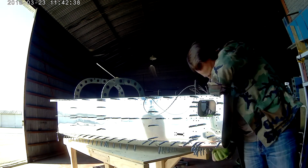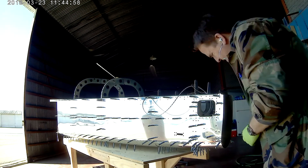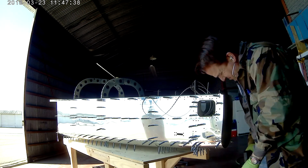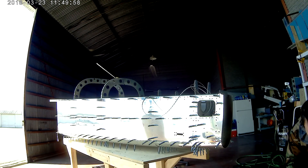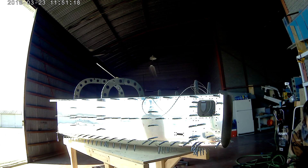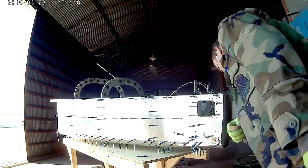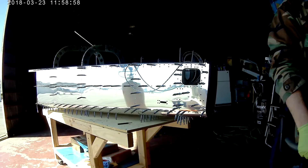You only rivet the bottom and it says to go from the inside out. This is something you can handle as a single person — though two people would definitely be advisable. If you've got a lot of practice and you're confident, go for it. It can be a little tricky because those are flanges, just like the front of ribs with individual flanges that have rivet holes. Treat them with extra respect because they might not automatically bend to the roundness of the bottom skin. When you push the rivet through and can barely see it popping through the second piece of metal, you may need to size up — maybe a three, a four, or even a four and a half. Just play it by ear once you start putting rivets in.